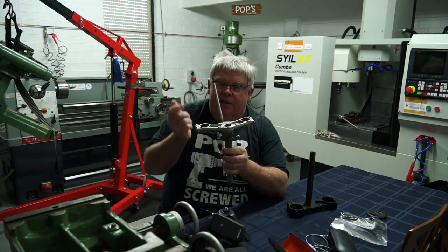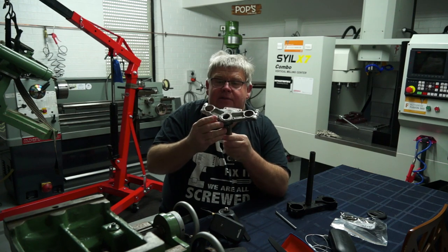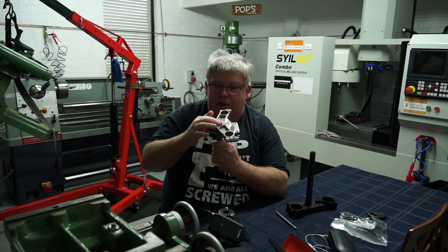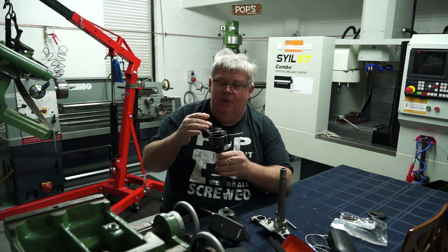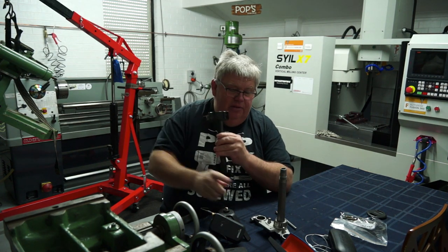However with the old magnet test we can see that it's steel. The problem is that it's machined - it's been pressed in and welded in here. He wants this aluminium one placed in its place. So we've got the top part of the headset here - that's an aluminium one and this is a steel one.